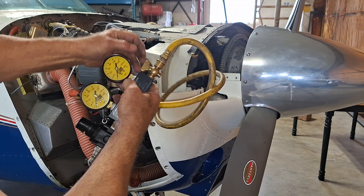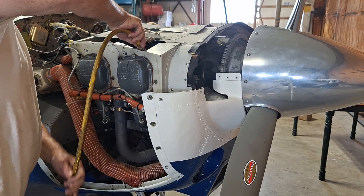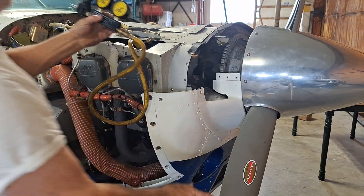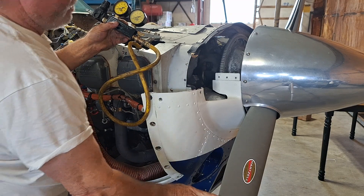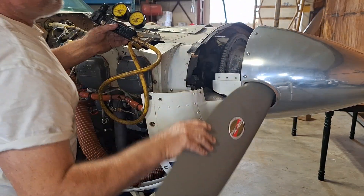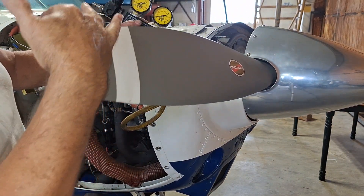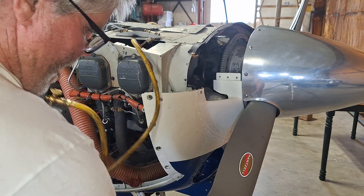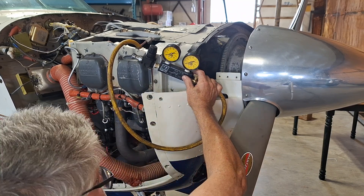I'm going to turn the pressure back to zero on that gauge. I've got an adapter screwed into number one cylinder on the top spark plug hole. I'm going to rotate the engine around in the direction of rotation — if this was anything but a Lycoming you would hear an impulse coupling click about at the seven o'clock position, which makes it easier to hand-start. I keep turning and I can hear some air come out of my gauge, and it's resisting, so I can feel it's coming up on the compression stroke. I'm going to bring it down close to top dead center but do not go past — the instructions specifically say not to go past top dead center for a compression test.